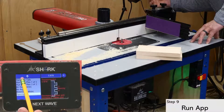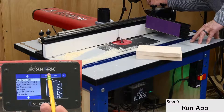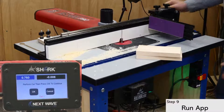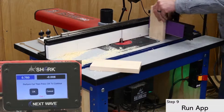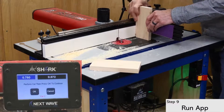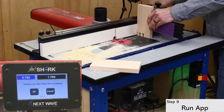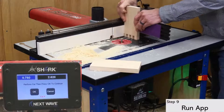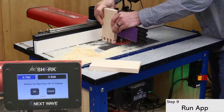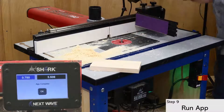I'm now ready to run the tail portion of the joint. Proceed through each screen until the tails are all cut on the end of one board. Notice I'm cutting forward and then carefully pulling the board back over the cutter — this creates the double pass that I used in the test board. On the last pass, hold the board extra firm and feed it slow since it's a climb cut, and the rotation of the bit can pull the board away from the fence if you hold the board too lightly or feed too fast.